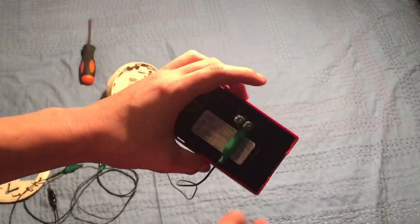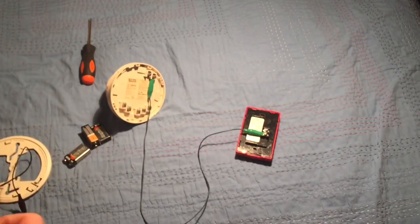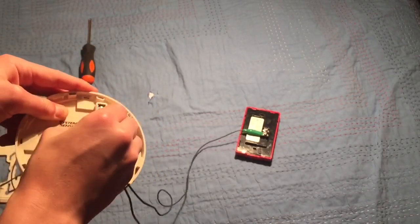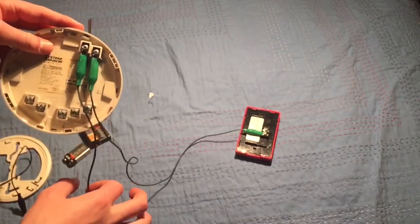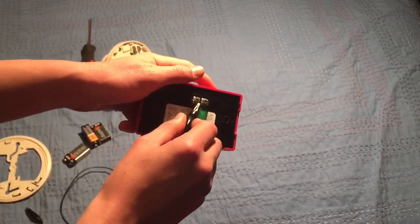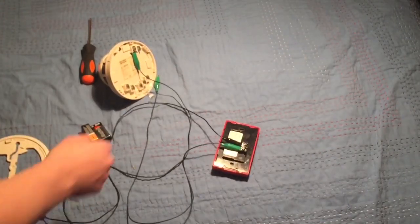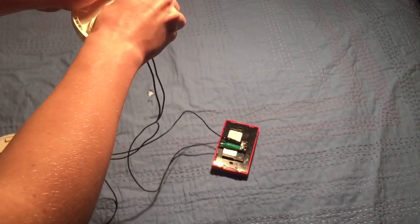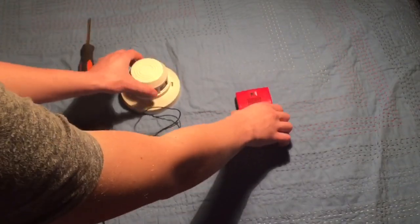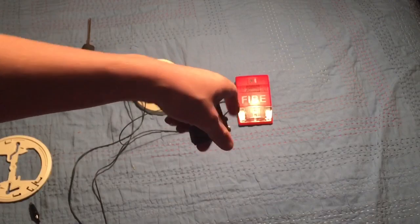So you have minus going to plus. Next, go back to your smoke detector and take your other wire to the plus terminal — connect that, and this wire will go to the plus of your battery. Then take your last wire and hook it up to the negative or minus of your strobe or horn strobe. Make sure nothing comes loose, and everything's good.